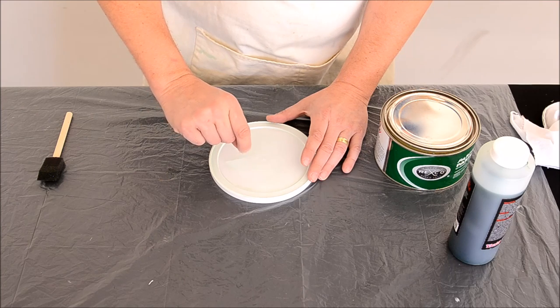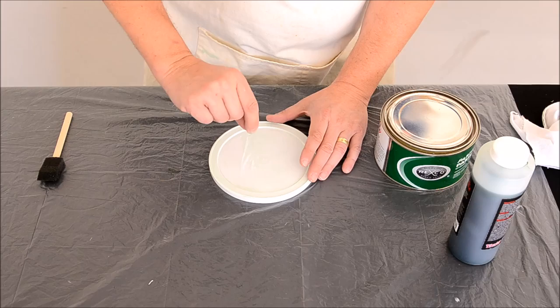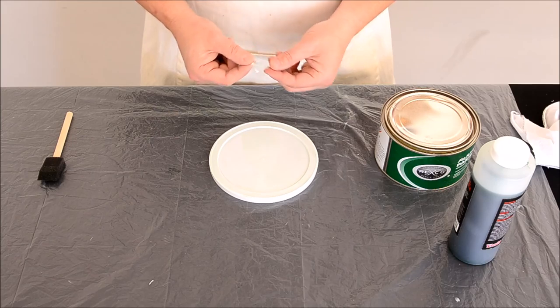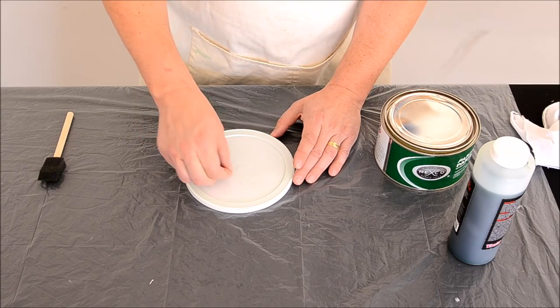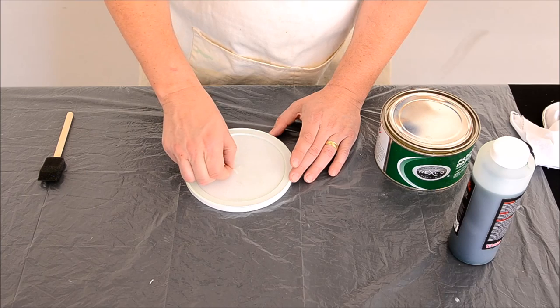As seen, the film parts easily and cleanly from the surface. Because it is water soluble, it will dissolve from the molded parts and spray equipment with water. It leaves a tack-free, durable surface. PVA is not recommended for use with resins containing water or giving off water during cures, such as phenolics, or with automotive finishes, as damage may occur.